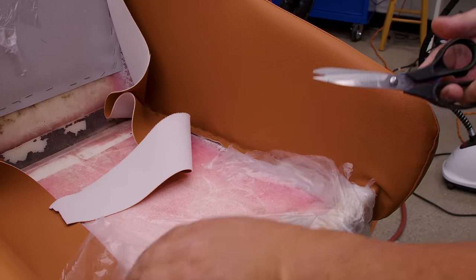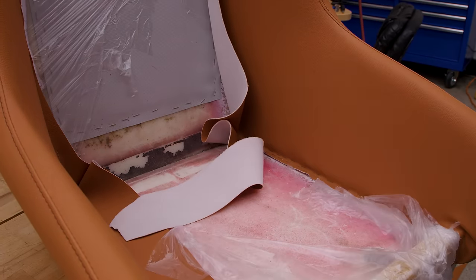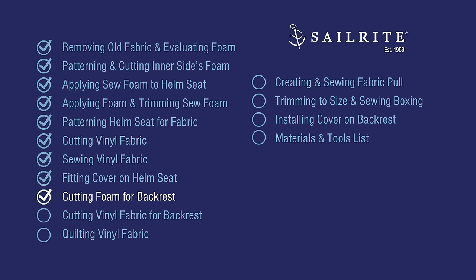Once that's done, we're going to start working on the underside. As long as the wrinkles are on the underside, nobody's going to see them, so make sure the vinyl is nice and smooth. At a corner, one way to reduce the bulk is to cut a 45 to the corner, stopping short — about a half inch from the corner — then cut the other side stopping short, and simply take the triangle out. Then you staple these down, pulling taut. This is a steamer, and these wrinkles are obvious on this side. A steamer will usually take care of this issue without causing damage — and look at that, they are totally gone. The last step is to trim close to where your staples are to get rid of the excess.